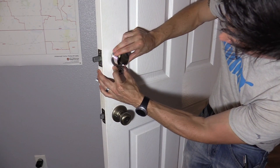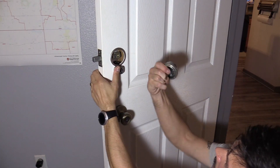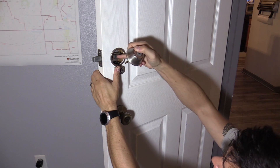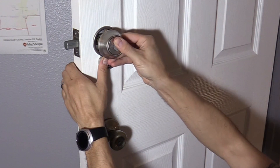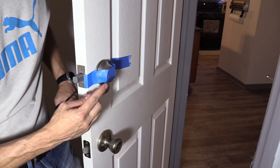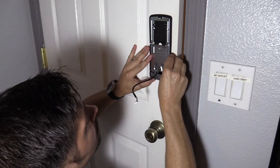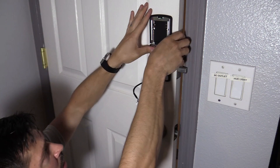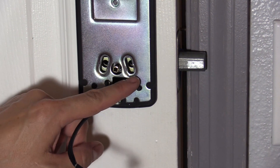Make sure it's lined up and straight, and make sure the torque blade is facing the same direction as the opening. Go ahead and slide that in. You can use painter's tape to hold the door lock in place while you mount the other side. Insert the cable in the bottom hole, make sure the torque blade is centered in that hole, and press on the tape. The torque blade should be centered in the hole, everything lined up, and the cable locked in. Make sure the lock is vertical.